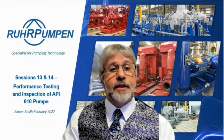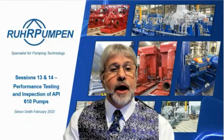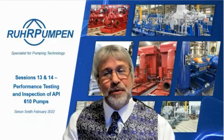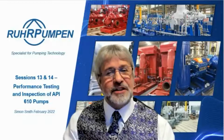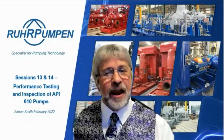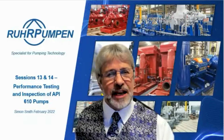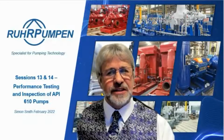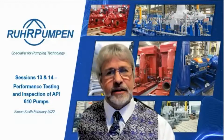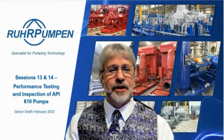Guan Zhang says, thanks for the presentation. What's the relationship between NPSH required and RPM? A tricky one. Many people will use the affinity laws for that, but it's not strictly accurate. It varies from it. So the simple answer is to say there isn't really one. You can use the affinity laws to get an idea, but it's more complex than that, and so you actually need to look at actual NPSH figures for that.